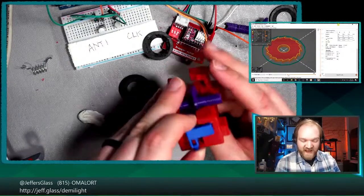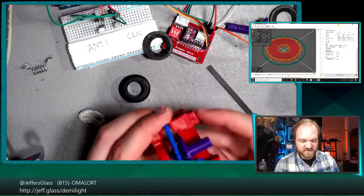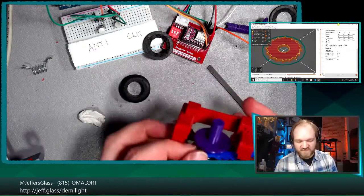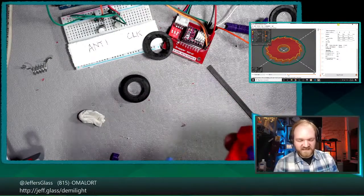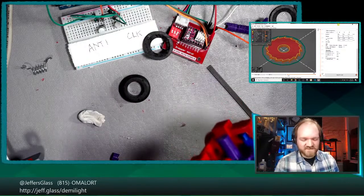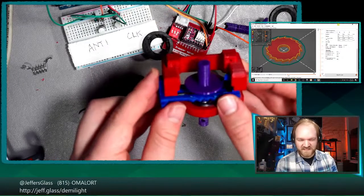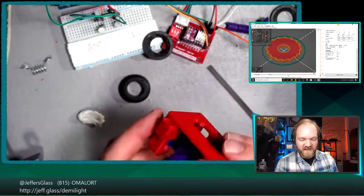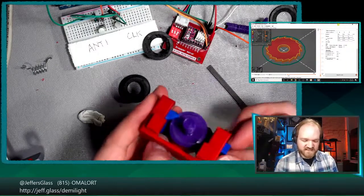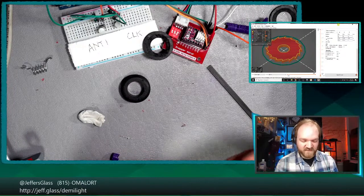The indicators we had purchased, I think, are 12-volt indicators, and the power supply for this RS-485 converter is a 5-volt power supply, I think. I'm mixing up the voltage here. Suffice to say, they were not the same voltage, and so there would need to be some voltage level conversion. One thing we have a bunch of in storage at the museum is solid state relays, kicking around from a couple of previous projects.